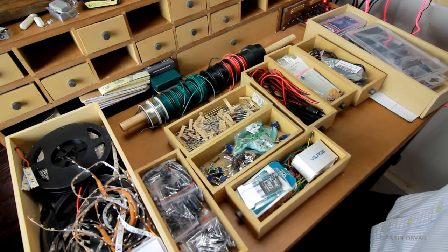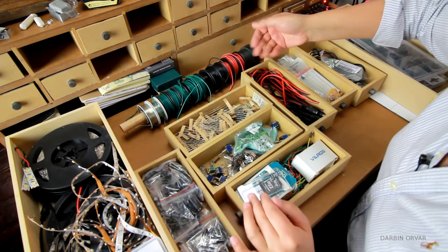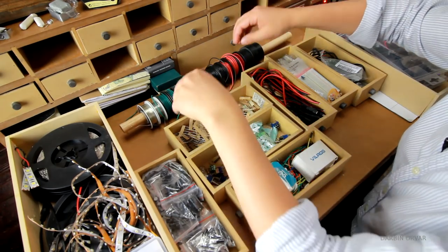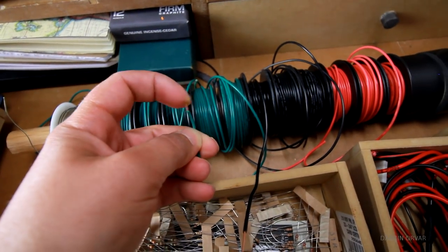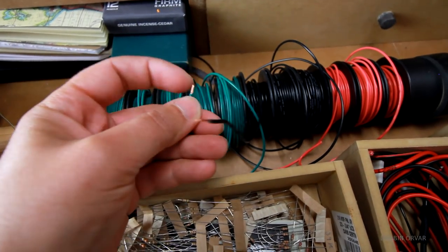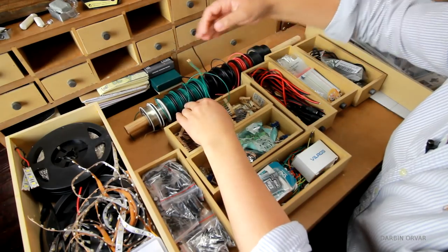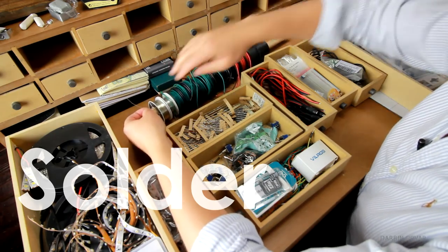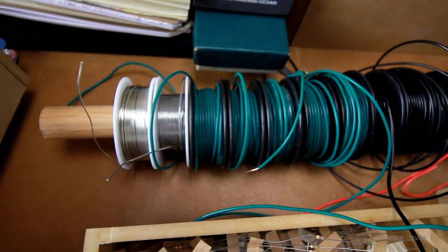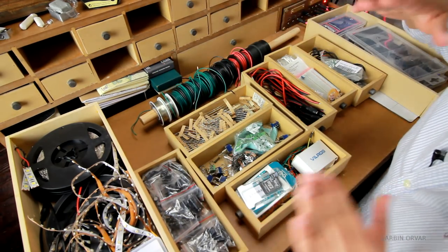In terms of supplies, one of the most important things is wire. It's nice to have three different colors for positive, negative, and ground. I have both 20 and 22 gauge — so thick and slightly thinner wire — and I also have both solid and stranded. You can definitely tell the difference, and they're used for different applications. Another thing is solder. I have thicker and thinner solder — they're both pretty thin. You don't want to use the kind for plumbing; that's way too thick. You need to go with the thinner stuff.